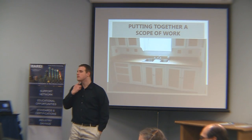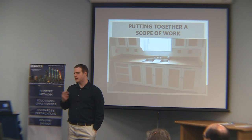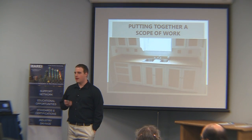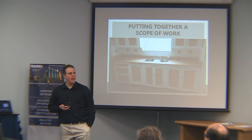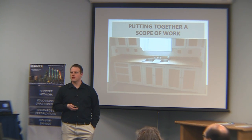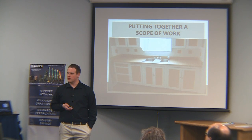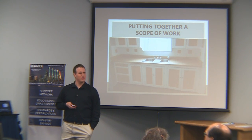What do you do when you have non-grounded outlets? Grounding is nice but — don't put in a ground and fake it. You just have to get the right cutout ones. Do you put GFCIs in? GFCIs don't work as grounding — it's not a ground. We have not dealt with many non-grounded outlets; the vast majority of houses we run across do have grounded outlets.